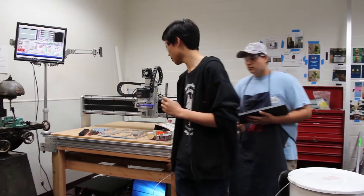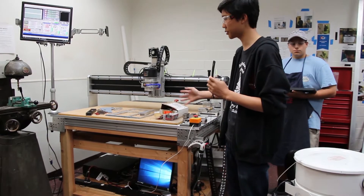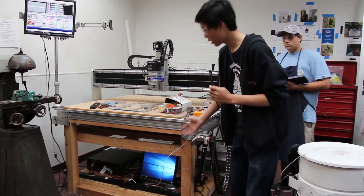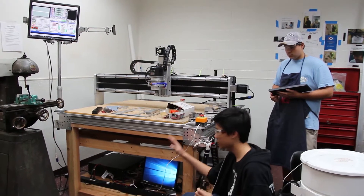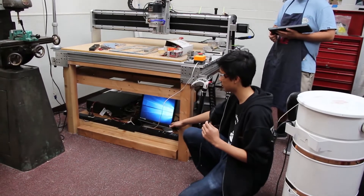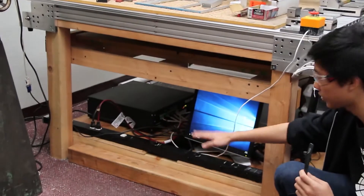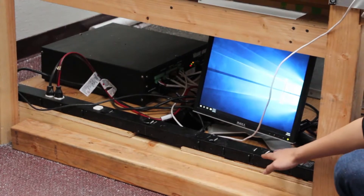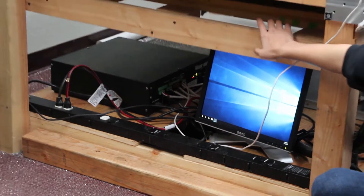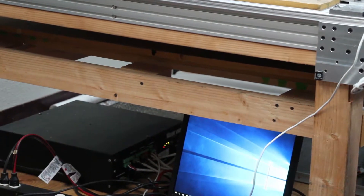To start off, we'll talk about our CNC table. We constructed it ourselves, which we CAD'd up first. It's made out of 2x4s, 4x4s, and some plywood. We have three layers here: a ground layer where we store some stuff, a first layer with the computer setup, storage, the power strip, and the CNC control box, and above that, storage for all of our MDF sacrifice boards and other sheet material.